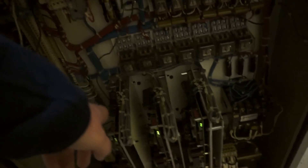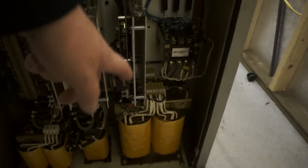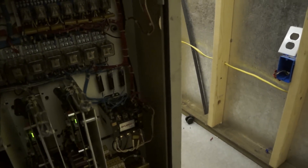Coming over here we have the electronics. These are the three servo amps. That's the power transformer for the servos. And these are what they call reactors — I think they're big inductors. Lots of transformers. This is the 24-volt DC supply that runs everything. This huge box down here is the main contactor. Let me see if I can reach the e-stop button.